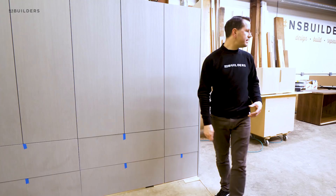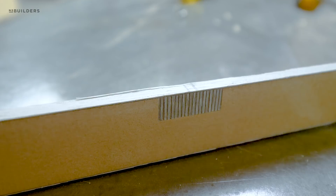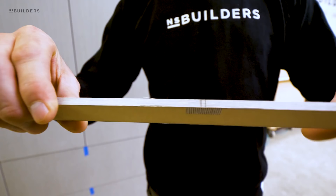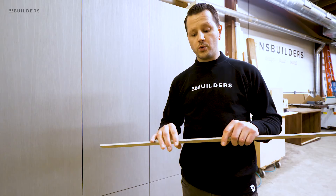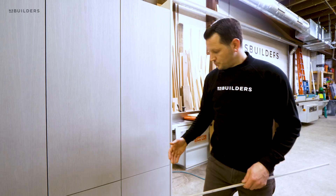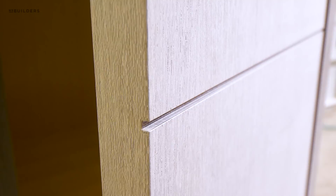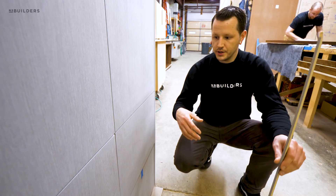This is a section cut off of what this door actually looked like. Across the face of the door you can see we ran a pretty big dado here, and basically we made our own solid stock with thin strips of veneer, building it up to about an inch worth of material. We drew our lines of where we wanted the curve to land. Before we veneered the face, we added that dado, filled it with our made-up veneer stock, and then veneered the face and the back. Once that was all set up, we were able to go back, follow our lines, and cut the curve right in there. The final result — you can see the veneer comes up the face and basically waterfalls or returns right back into this curve on both sides, giving us the same graining, the same coloring, everything. There are no issues later on in finishing trying to match anything.